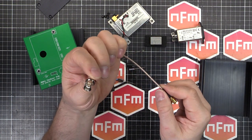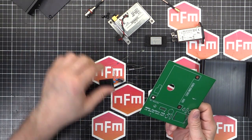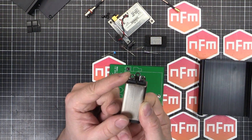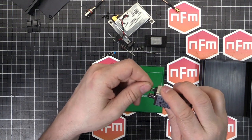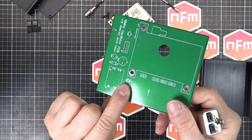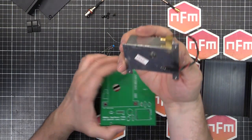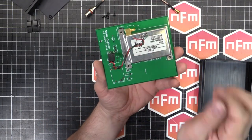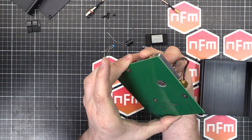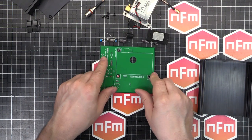And then we've got the BNC which is going to go through the front panel, once I drill the hole, to give us our 10MHz out at 50 ohm. So the next step would be to populate this board. For the power coming in you can see it's got nice big chunky terminals. I'm going to solder on, or maybe just crimp, with some push-on terminals to some smaller wires, and they go into this terminal for 5 volts. The rest of the components just go in through-hole like normal, and this will just screw straight down onto place. Let's fire up the soldering iron and get to it.